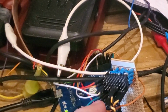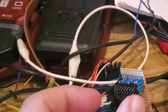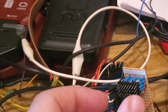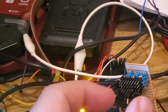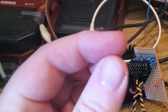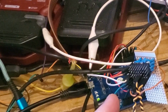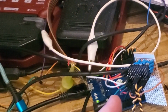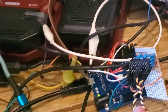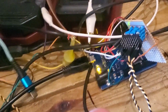I think there's a better way of doing it. When I did it before, I put these in situ in a controller, into a header to hold them together. And actually it'd be better to separate them differently. It'd be much better to make a curly tail for the diode lead, push that down and solder that on every other pin of an 8x1, and then put them together and solder the leg for the resistor. And of course it would be much better not to make the mistake I made here of accidentally moving. I didn't count the pins.